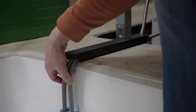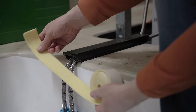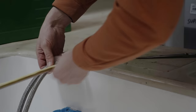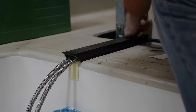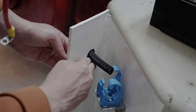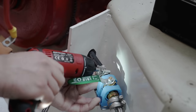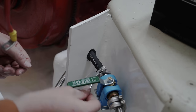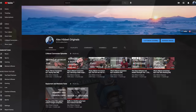To prove I do read the comments — the ones that aren't deranged, anyhow — I've tweaked a couple of things from past videos. First, an abrasion-resistant Kevlar strip to stop the stainless hose braid cutting into the gel coat. A quick trick to get something floppy through a conduit like this steel channel: I taped the strip to the end of a length of spare thin aluminium bar, which let me push it through and then remove the bar. I also installed a nitrile grommet into the fiberglass panel to protect the fuel hose from vibration abrasion, and reversed one of the hose clips ahead of converting to superior permanent O-clips.